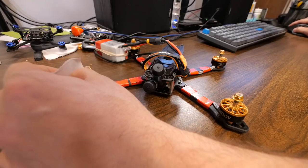Motor number four is also spinning the wrong direction. So for me, motors 3 and 4 need to be reversed. That is probably not the same for you, because the exact direction the motor spins depends on how you wired up the wires, and you probably didn't wire up your wires the same as me. At this point, there are two choices for what to do.